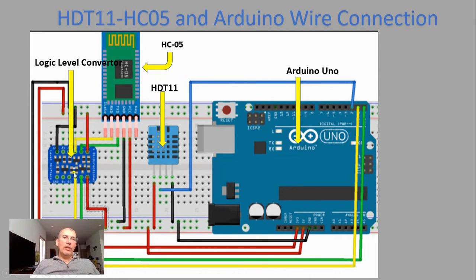Basically, the logic level converter is needed because the HC05, even though it is powered by 5 volts, still needs 3.3 volts for data transmission, TX and RX. So we need to convert high voltage to low voltage. That's why this is needed. This diagram will be on YouTube and in the description, including the code and block diagram for the MIT App Inventor app.